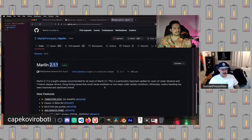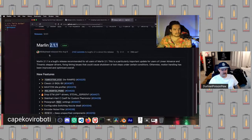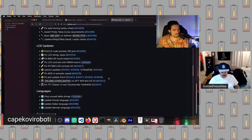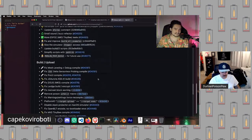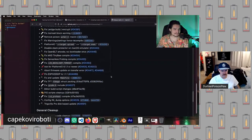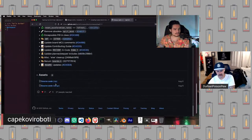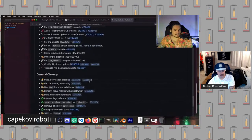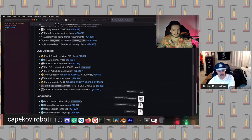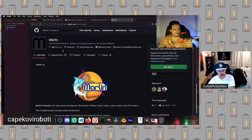So over here on this releases page, we can see good old Scott Thinky Head has been making some changes here. He has been the major force behind Marlin since its inception. We're going to scroll down here. These are all just different changes that have been made since the last release. You can see this is a very actively developed project. There are dozens and dozens of changes every release, and new releases come out with quite a bit of frequency. So we're going to come down here and grab this source code zip. I have already downloaded this, so I'm not going to re-download it. You can see it's right here in my downloads, Marlin 2.1.1.zip.